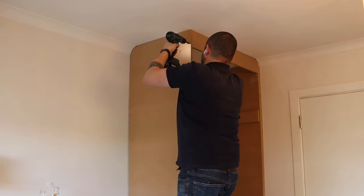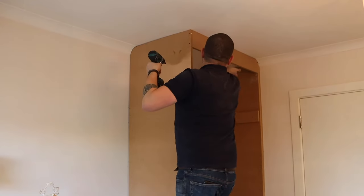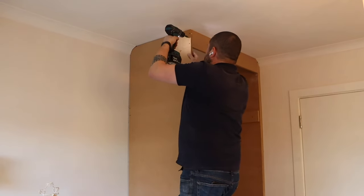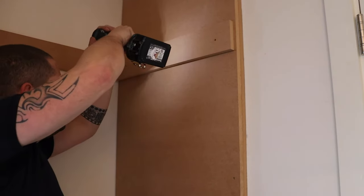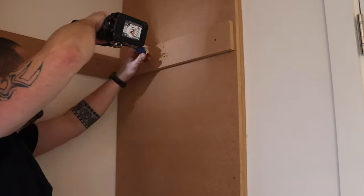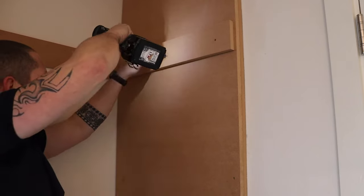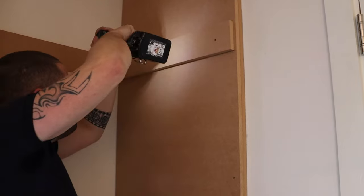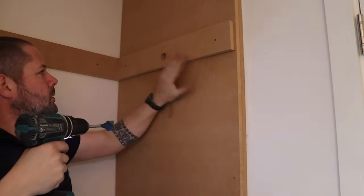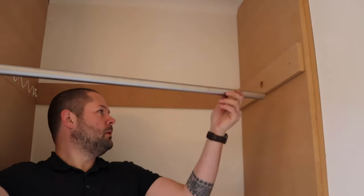You can see it's starting to take shape now — we're not a million miles away from the fully finished wardrobe at this stage. Obviously decorating, sanding, and filling all come later. This is me drilling out that hole I was telling you about — it's just going to receive the hanging rail. My hanging rail was 25mm so I drilled the hole out at 28mm just to give it a little bit more room and make it easier to put together. Going on with the other side now, screwed and glued on, and you can see the hanging rail go in.